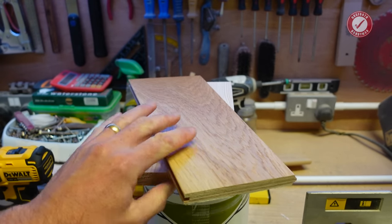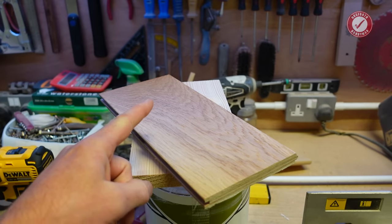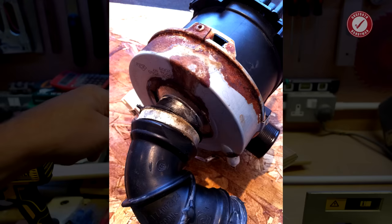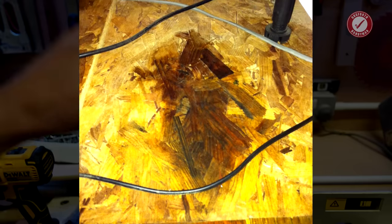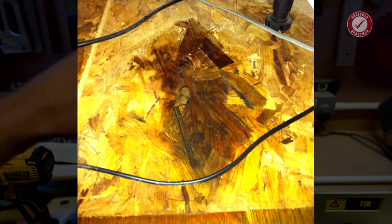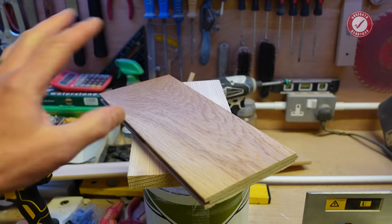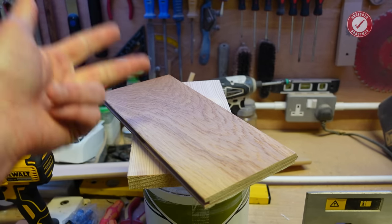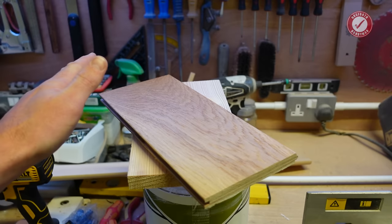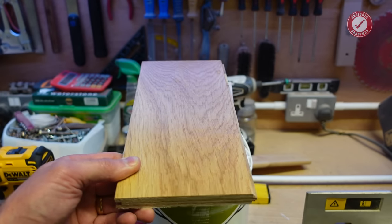One of the reasons that I want the floor under all of the units is that the most common problem I've seen over the years is a dishwasher leaking and the water going underneath the floating floor. That will cause major bowing and it never ever dries out — unless you lift the whole floor up it just doesn't dry out properly. So in this kind of situation where we've got a fridge freezer, a stove, and a dishwasher, all of that needs to be above floor level anyway. So the general takeaway from this is: do as I say, not as I do.